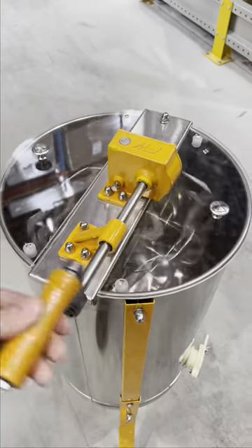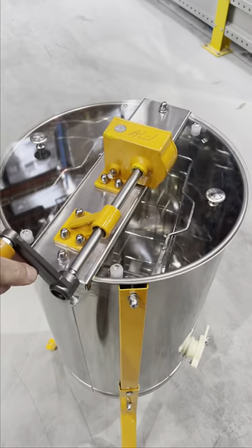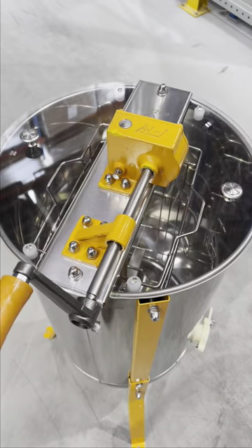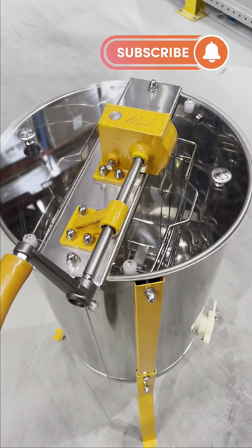The big plus is if I get this up to a decent speed and turn it anti-clockwise, the brake suddenly engages and stops the cage from rotation. That's a great feature in case something gets caught in — you can stop very quickly and stop the physical rotation of the cage.